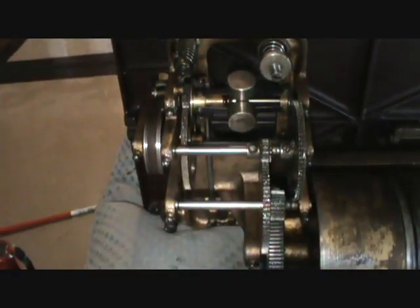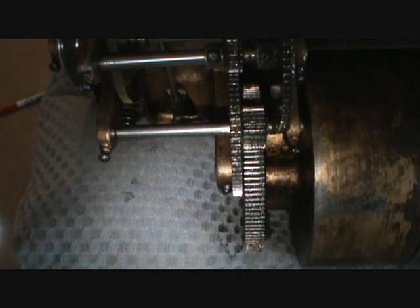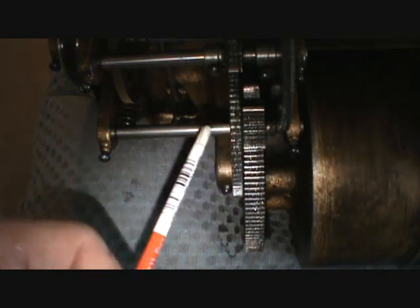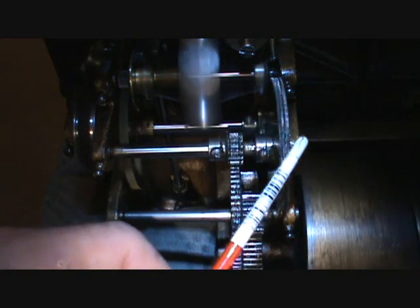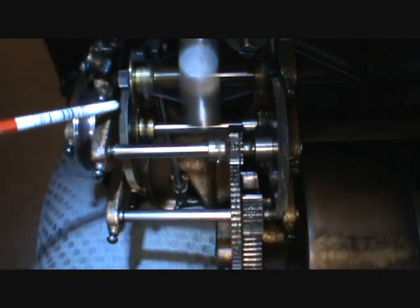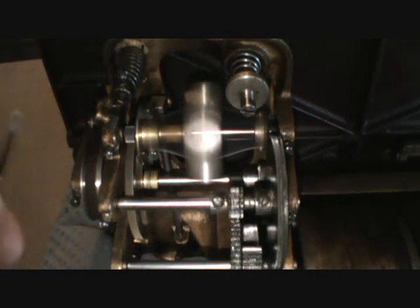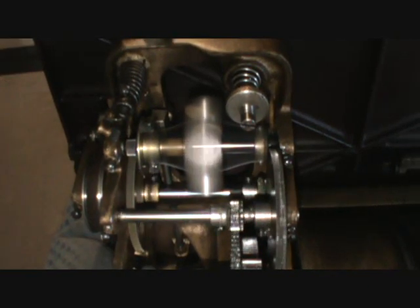Here I'll show you what the mechanism looks like as the springs are unwinding — starting down here and panning upward. As you can see, the large bull gear is turning, thus turning the smaller gear here, which in turn turns the large gear on the same shaft, which turns the small pinion gear on the third shaft, which turns the fine-toothed brass gear on that third shaft, which turns the very tiny pinion gear on the governor shaft, which turns the pulley gear with the belt attached to it, which turns the pulley on top of the mechanism and turns the mandrel to play the record.